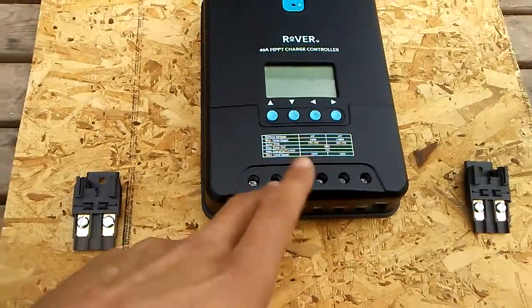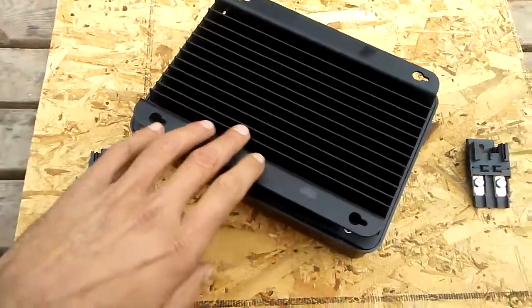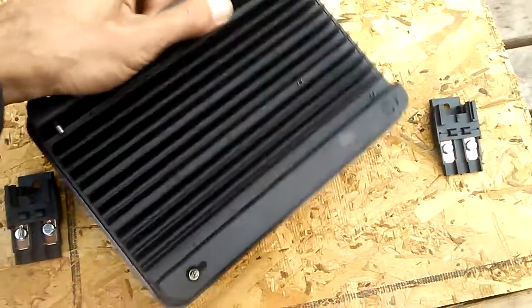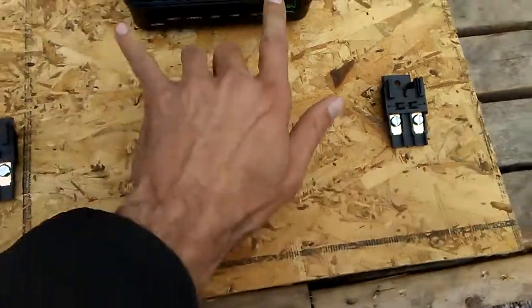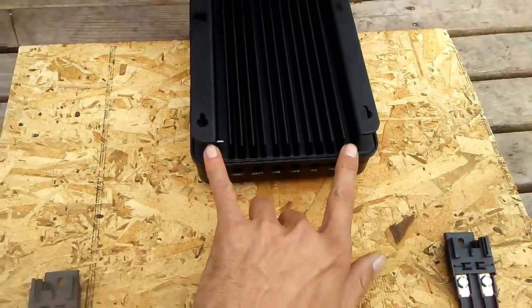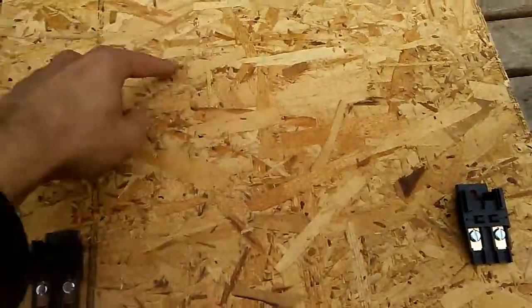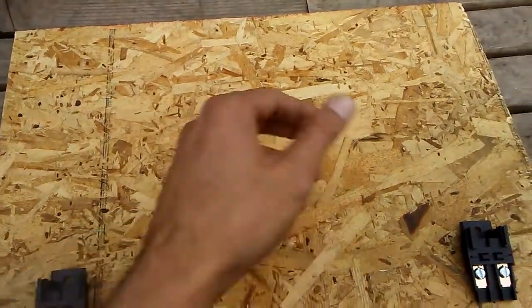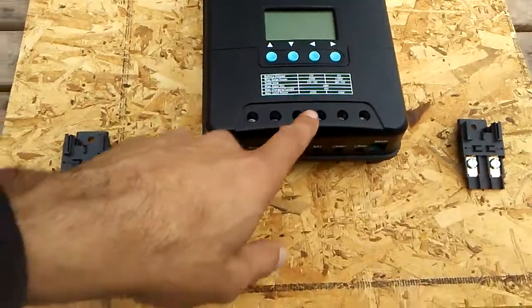What I need to do today with this panel is — on the backside of this 40-amp charge controller there are cooling fins. What I'm planning to do is cut a hole as wide as this, right in here, and what that'll do is give a sufficient amount of airflow underneath the cooling fins to make sure it's cooled properly. So let me cut this out and we'll go back inside and mount all this stuff up for you guys.